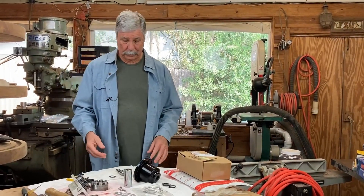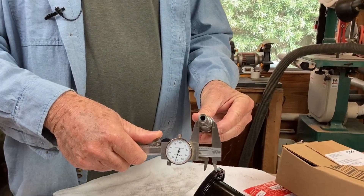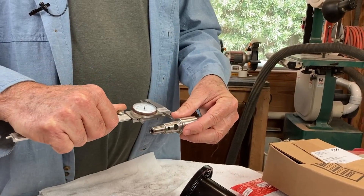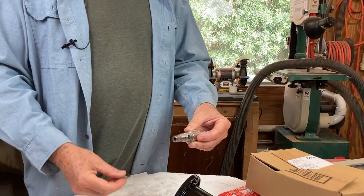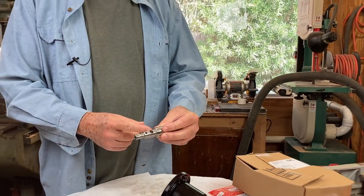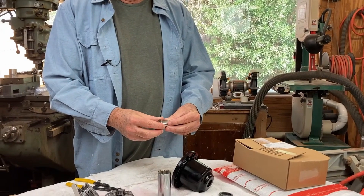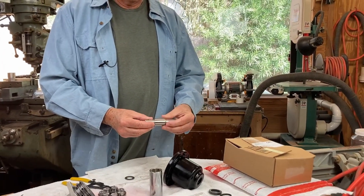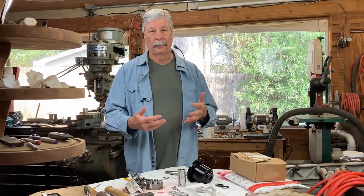So this is what I customarily do: I take the measurements — what's the inside diameter of the groove where the snap ring goes in, and how wide is it. There's certain engineering knowledge you need to understand what that groove is all about and how much room you actually have, especially given other things that go with it. But for the most part, that's all you need. Instead of looking for a part number, I look for part dimensions.